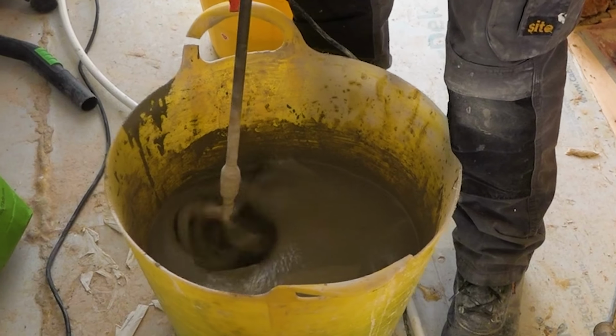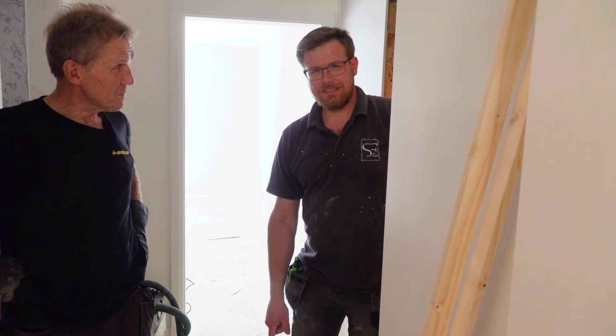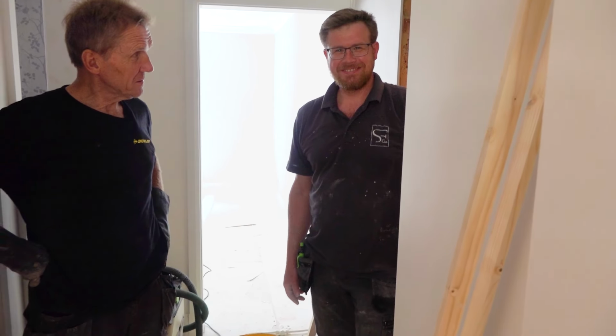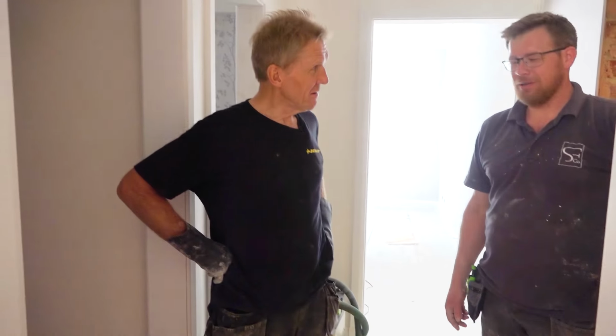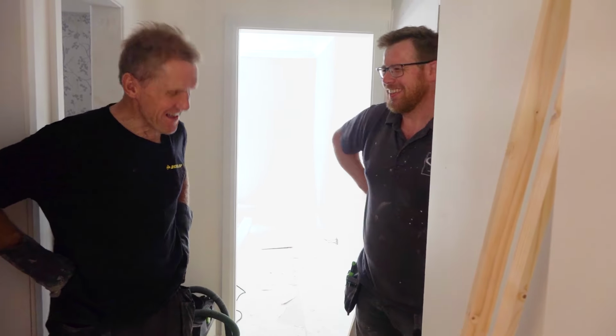Right, here's a 2 minute tip for you. When you're mixing up your Dunlop self-leveling screed, you mix it, leave it for 2 minutes. Is that a 2 minute tip? It's 2 minutes and 30 seconds actually, because then you mix it again, then you're ready to go.